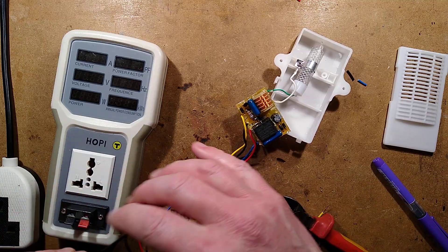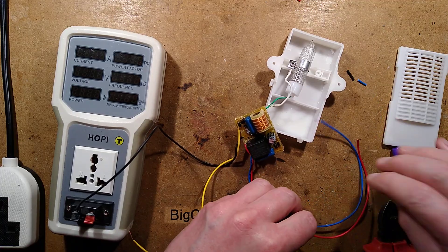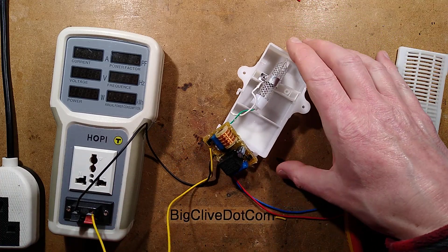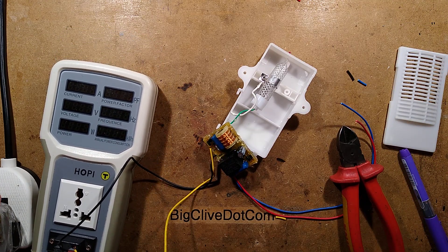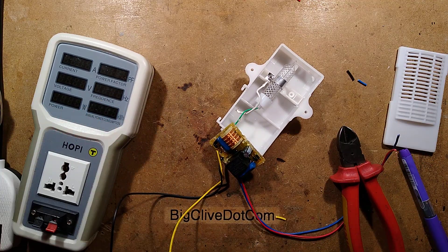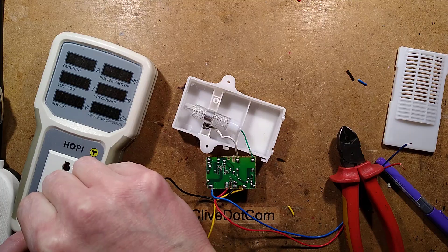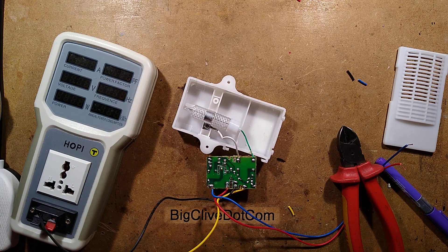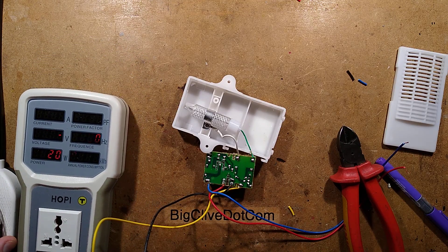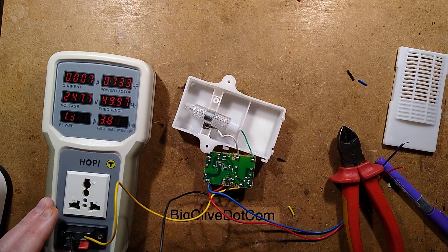This is the scary bit. If I keep the black in and tuck the red and blue out of the way — those are part of the safety circuit — then this should make a loud buzzing noise. Let's put the common connection and the yellow, which is the drive for the high-voltage circuitry, and see if it goes kaboom. Oh, it's making a loud buzzing noise. I'm getting the ozone — it's not strong. The power consumption is 1.3 watts, 7 milliamps, 0.7 power factor — that's surprising given it's only half wave.